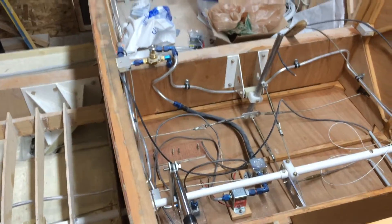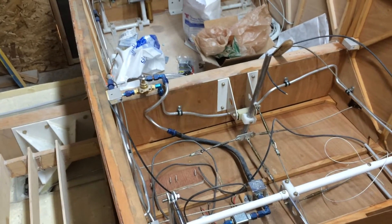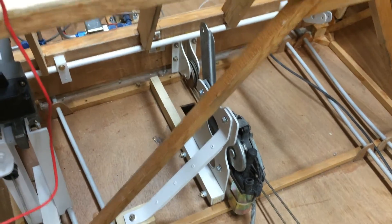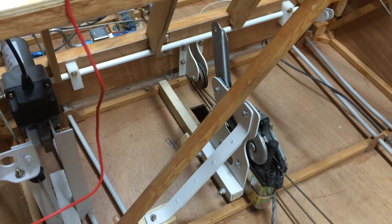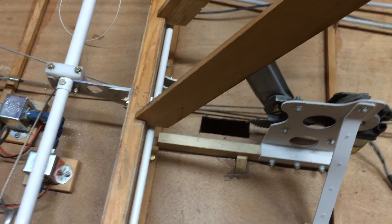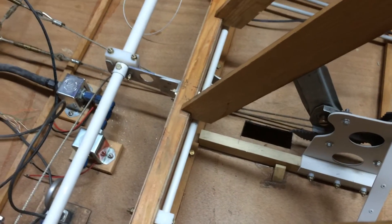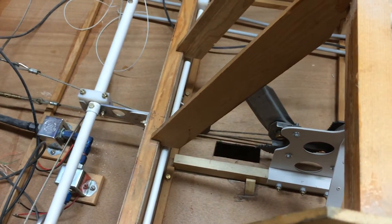There's been a lot of talk on the net lately about spoilers and belly boards, and I'm sure I've generated a few of the questions, and I think we've come up with a good design. As far as the spoilers are concerned, I took a window actuator out of a 1998-2009 Honda Accord — the right side — cut it up a little bit, rearranged it, did some mounting, and made a new plate. This thing travels very, very smooth. I mentioned on the KR net that I accidentally pushed it down one day when I had a bucket or something underneath the airplane and it lifted the airplane right up. So I'm pretty happy with the torque — I think it should overcome anything that the wind can throw at us.